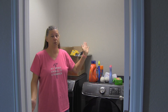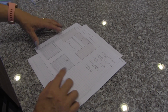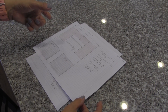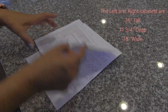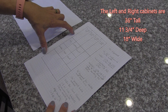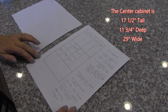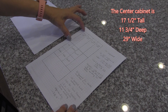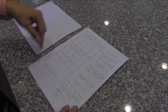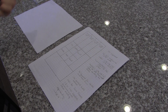My first step was to draw out my space where the cabinets were going to be. After I drew out my space and decided how big I wanted my cabinets and what size, I went ahead and drew a four-by-eight sheet of plywood on graph paper and started drawing out what cuts I needed to make. The first two cuts — four feet by three feet times two — I had the lumber yard cut them, because it's easier for me to maneuver the smaller sheets.